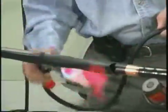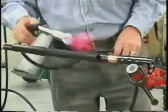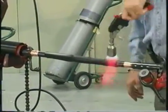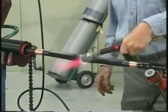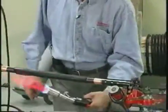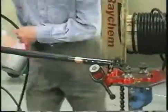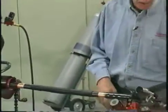You have to use a torch that has a bushy flame. I've repositioned the flame to point down the tube, and now I'll reposition it again to do the ends. Go back to the center once it's shrunk on that side. Be careful not to start to shrink the tubes over the other side. Finish it off with a little flame brushing just to make sure you've got it properly recovered. And that's the first tube completely installed.